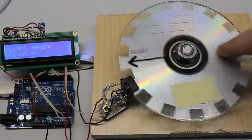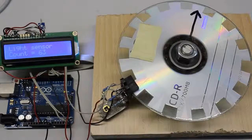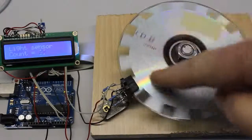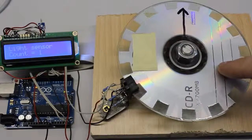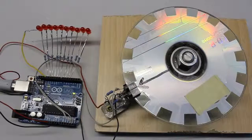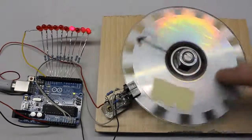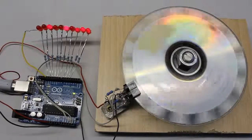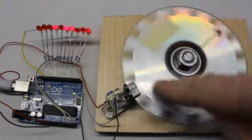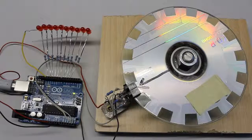Multiple clock cycles of the microcontroller are needed to control the LCD and so to display the numerical value. Thus, if the disc is spinning with high speed, some pulses are skipped. Now, the disc is no longer at its starting position when the displayed value is 0. When using the LEDs to indicate the value, fewer clock cycles are required to display the counter reading, thus even at higher speeds no pulses are skipped. Hence, it is advisable to know the binary system if you are working with computers, especially with microcontrollers.